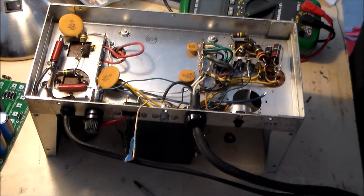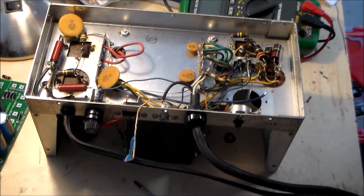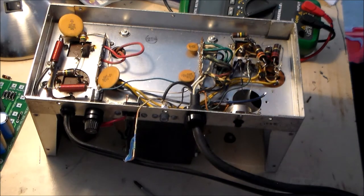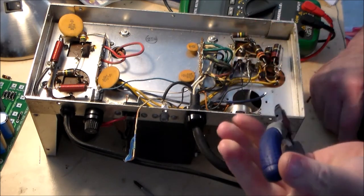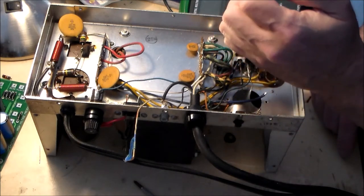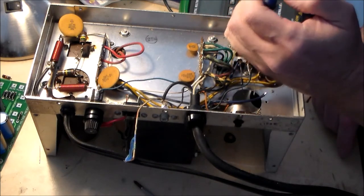Clip out the diode and ground wire from the capacitor you just removed from the two resistors. Now remove the capacitor. So we got ahead of ourselves. So we did the right thing. Clip out the remaining two diodes on the terminal strip between the two capacitors.